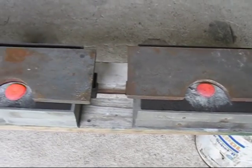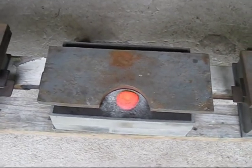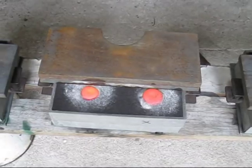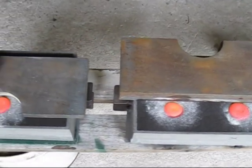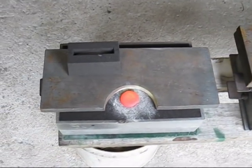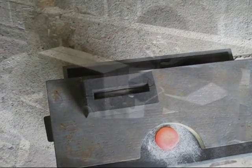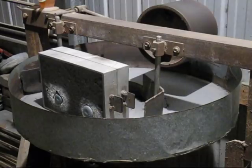I just finished pouring and I just scraped it in. I don't think I've got enough for a wedge test — maybe. This is the box — it's got the long skinny green core — let's see if it survived with the molten metal around it.